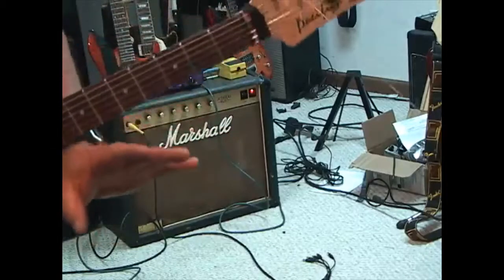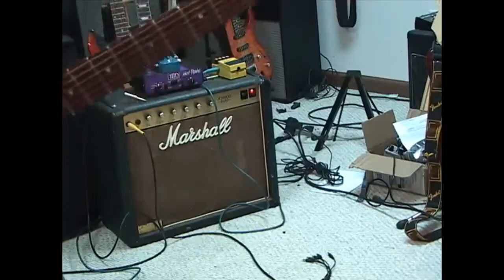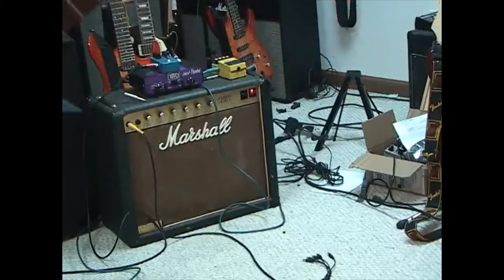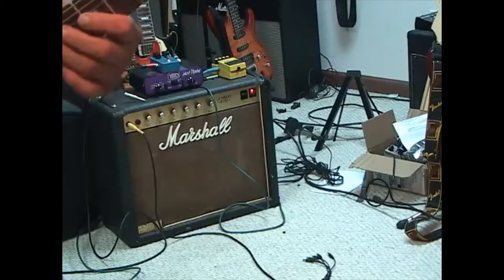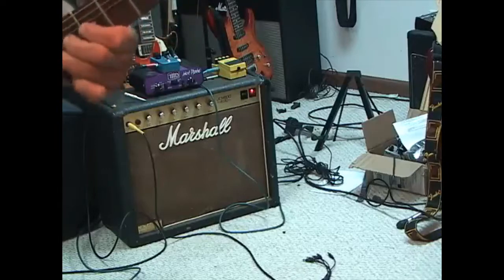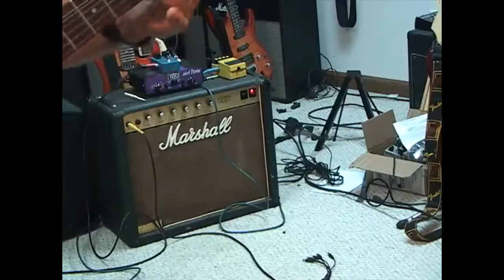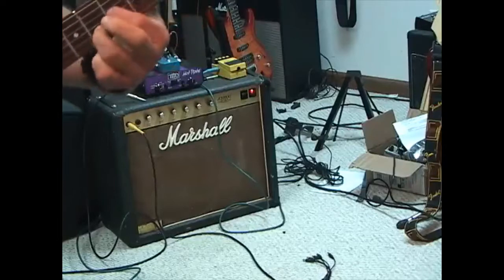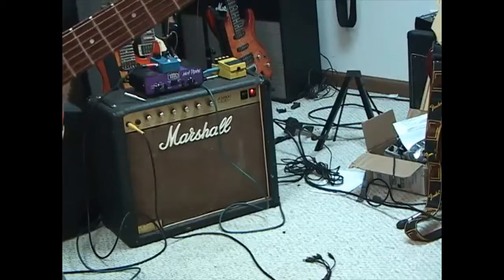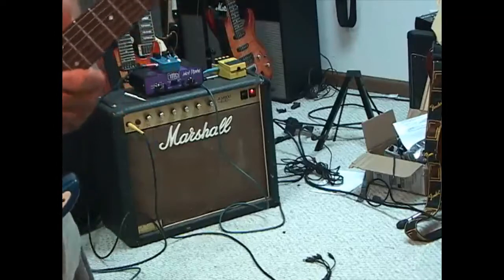This is just a little extra gain in the preamp because of the normal channel, the way I wanted the normal channel to have a normal bias on the first tube. That gives it a little hotter. It still cleans up the way I configured it. Cleans up, sounds just like a classic Marshall JCM800, but you can also clean it up halfway. Then kick on your bridge.